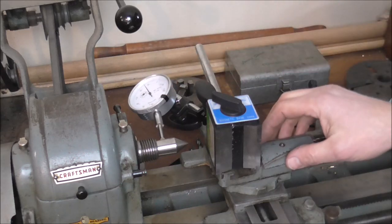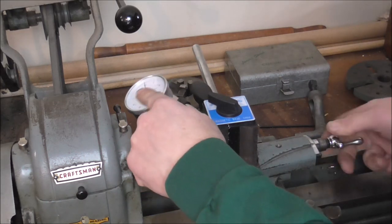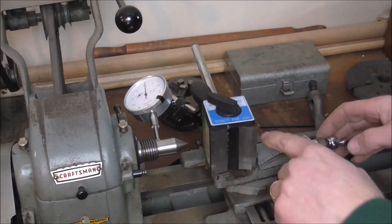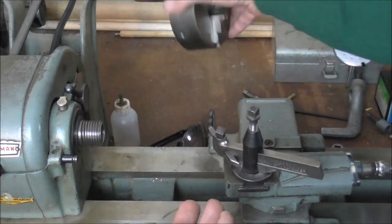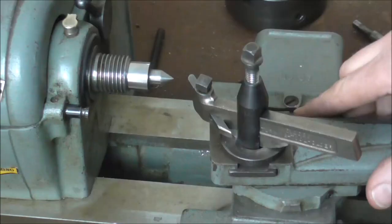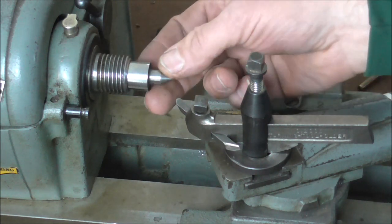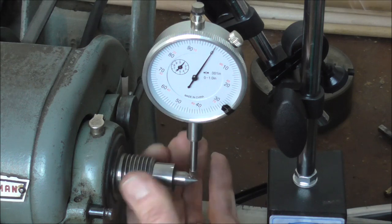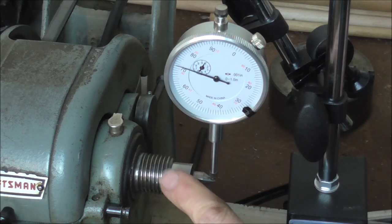So what I did is I took the dial indicator and I hooked it up to the compound rest and I set the angle for approximately where I thought it was supposed to be. And then by moving this back and forth and seeing how the dial goes, you can get the exact right angle with the compound rest. Once I had the right angle I took this off and hooked up the tool to here. Then I chucked a piece of steel into the lathe and I cut the same taper as on the dead center. Then I removed the chuck from the lathe. I made a little mark on the headstock and also a little mark on the tool so that I can line up those two marks. And then I reset the angle on the compound rest and I cut a point in the tool. Now when I line up the marks on the tool and the headstock on my new dead center that I made, it should line up perfectly. When I turn this, the dial indicator is right on — it's not moving at all. But if I take the tool out and turn it 180 degrees, then it's way off. So I need to make sure that I line up the marks and if I do, it should be about perfect.